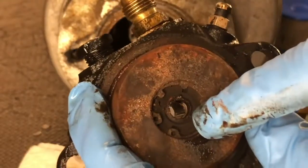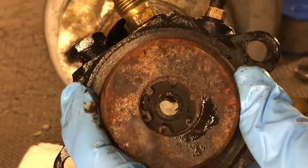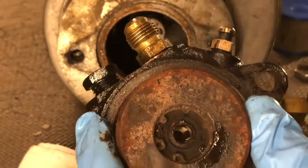This is the pump seal I was talking about in one of my other videos — where if you're using Teflon tape and it builds up too much pressure, it can start leaking fuel here and go right inside into the burner and actually cause a fire.